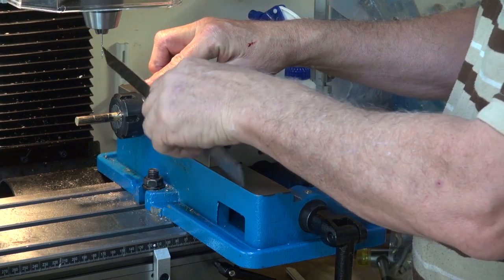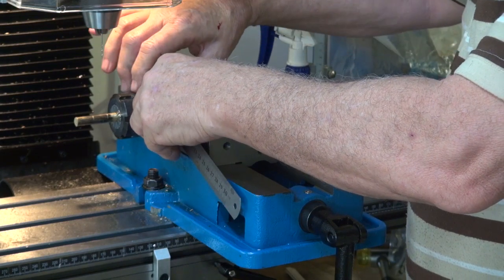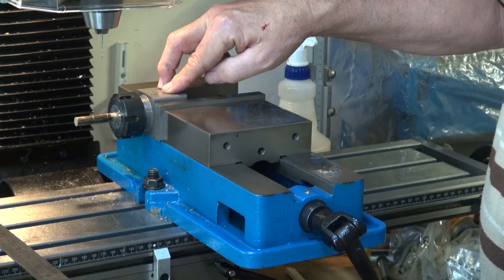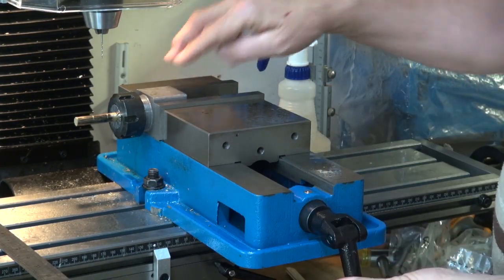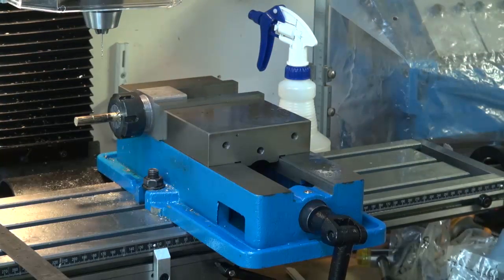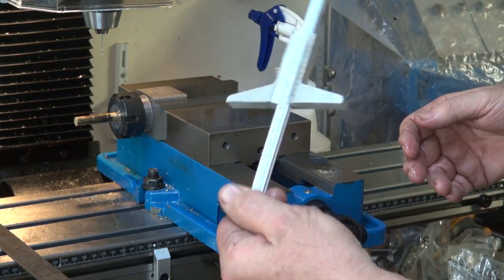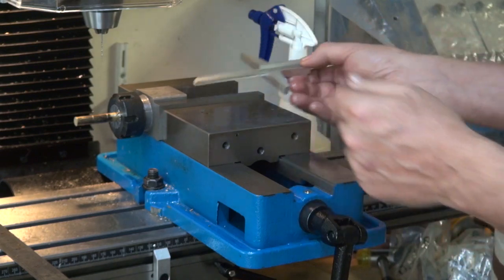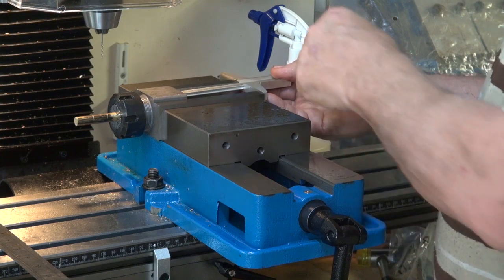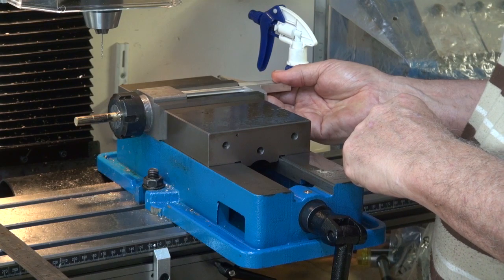It's a good thing when I've paralleled those jaws. If they are parallel, then when you're putting something in there you can just use a ruler to make sure they're square. Again, because I don't have an anti-rack block there, I'm not going to tighten this too much — and I don't really have to. If I'm doing a lot of these, I'll have a depth gauge set up so I can come in from the back of the vice and line up this collet block, getting it the same place every time.